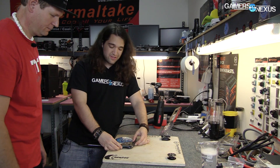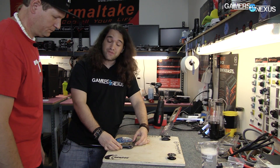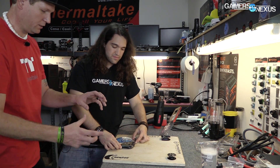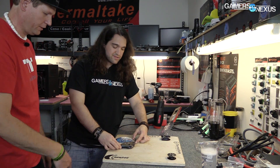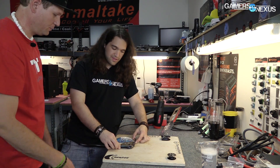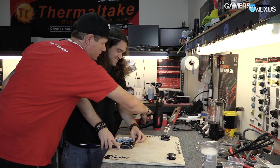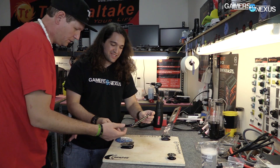Once you feel like you could bend it in a 90-degree thing, it's probably going to be pretty good. Let's shut this off and come down to the 90. Just kind of push it in right here — don't burn yourself because it does get pretty warm — and hold it there. It's just about 20 seconds and it should be pretty good. So then it's solidified like that. Remove the insert, and now you'll be set to do your cuts so you can get everything fitted for where you're going. If you need to make adjustments, you can always pull it out and get it ready.